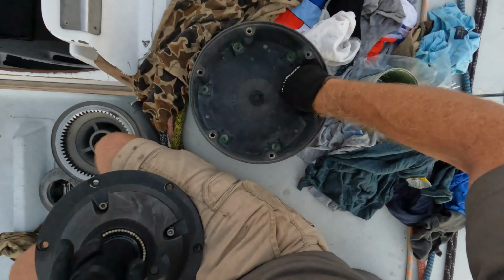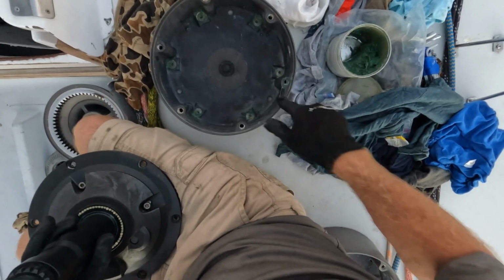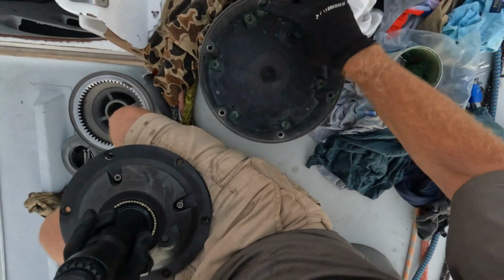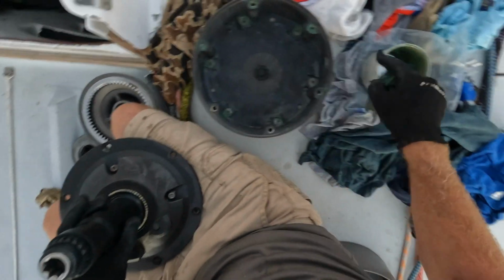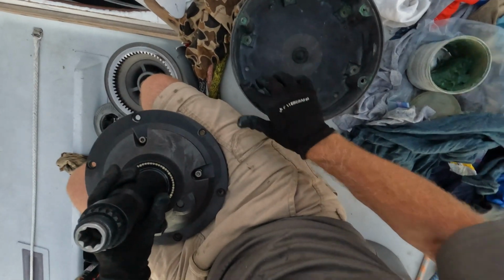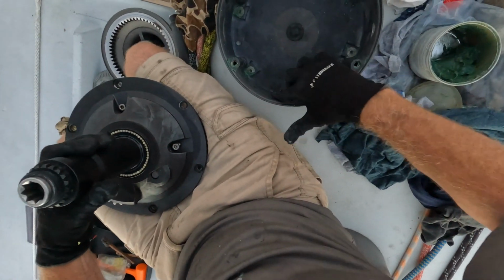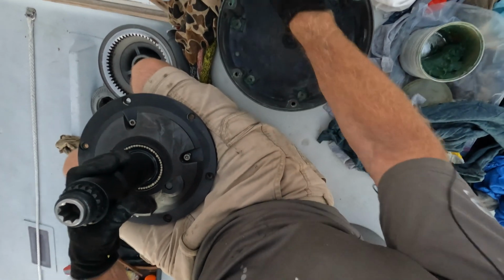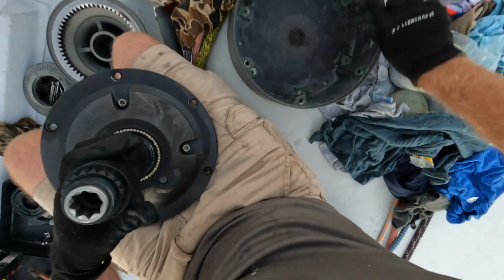It's clearly not perfect, so we're going to have to get in here and get these bolts undone. Same here, this position here, we don't want these getting stuck to each other. Sometimes the top of the winch, if you've got a really old situation with a boat, it's not been looked after properly, the top of the winch, this bit I've got in my hand here, it literally won't come off the base. So we can negate that by getting grease in here.